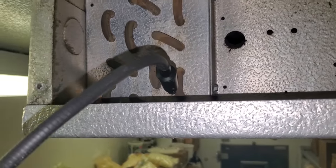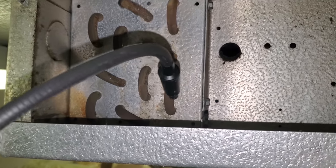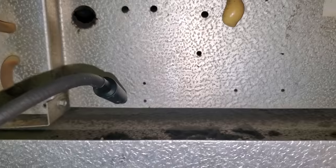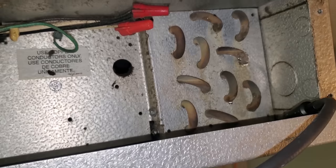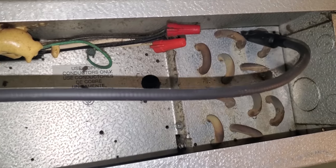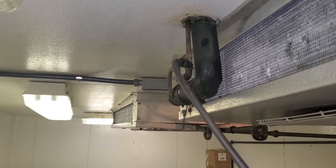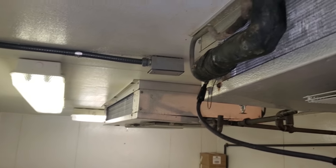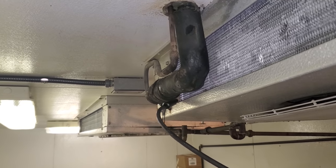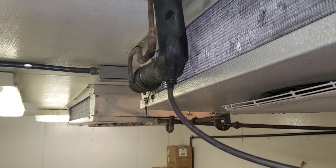Start at the ends — it's usually not leaking on these sides. Start at the bottom of the coil right down in there and see nothing, then just kind of work your way up. These leak detectors are super accurate usually, so you usually pick them up by now. Chasing the bottom here, then doing the same thing on the other side. Doesn't look like there's anything on this side, so we'll jump over to the other side. I nicked the insulation just a little bit to get inside — not picking anything up in there. I should pull back that insulation, but I would think the leak detector would pick something up. We had to add 10 pounds of gas, so I think it's either a really small leak that's been leaking for a long time or a big leak.